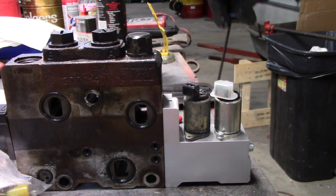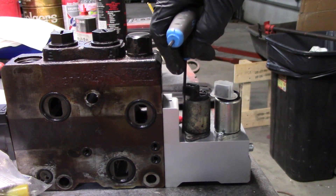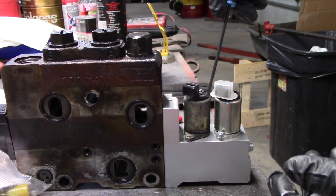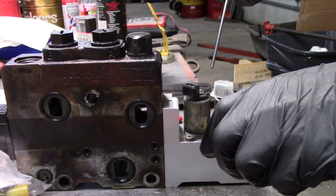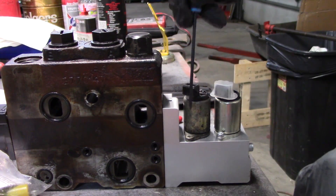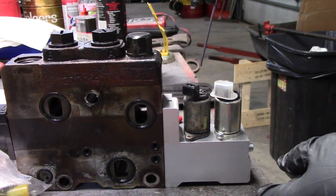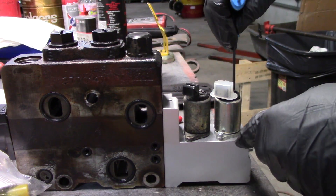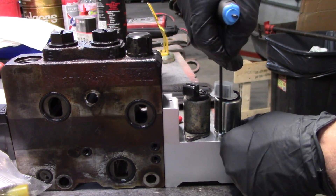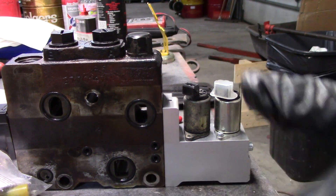On a new block it's super clean for demonstration purposes, but in the field you need to take that brake cleaner and spray all around these openings. If you need to, take a little screwdriver and scrape out all the dirt. On some - I think it's the K-90s, like on the Fabtec - this whole valve bank will be upside down and you have to do it by feel, or you take the whole block off and put it on the bench. Once it's installed, just snug them up - you don't have to over-tighten them, just snug them up.